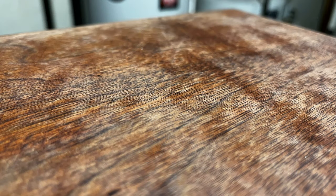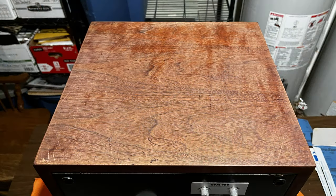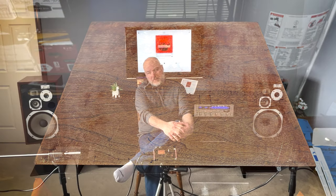So what I did was I sanded these down. I believe I used 120 and then I did 400 just to get the majority of the scratches out and get a nice smooth surface. The finish was mottled really bad before. The owner was treating it with some orange oil, which I use as well. But these speakers, I believe they got wet and it raised the grain on the veneers, and so the finish was really mottled looking. There was no amount of oil that was really going to soak in and fix that issue with the grain being raised.